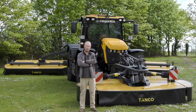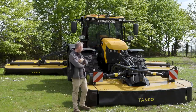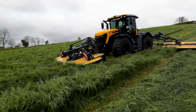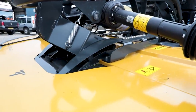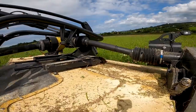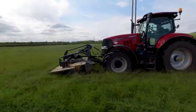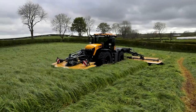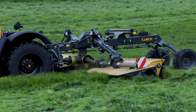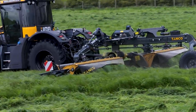On your front mower — and I know we looked at this last year — you've opted for the pull system. The front mower operates on a pull-type system; feedback from users was they all prefer the pull-type system. With the suspension it runs on a rail, the rail is part of a curve, so you've got super flotation in it — about 960–70 mm up-and-down vertical travel, left to right is about 19 degrees, front and back is about 16 or 17 degrees. So a super amount of travel.